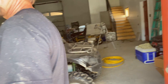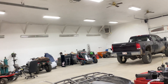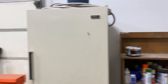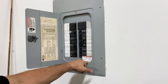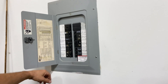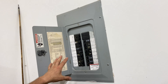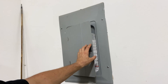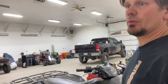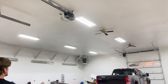Power was brought in — I didn't do this, somebody brought it in about ten years ago. They brought a number two aluminum, probably thinking they'd never add on to this place. But I would have brought 125 amps, and if 125 amps is good for a 1-aught, I would have ran a 2-aught.